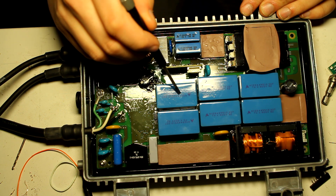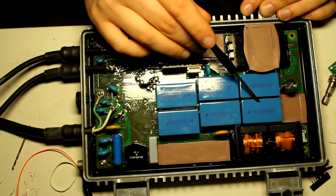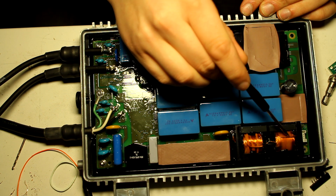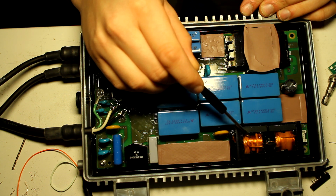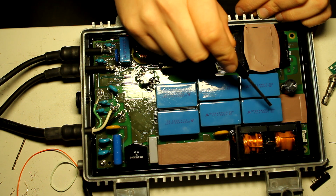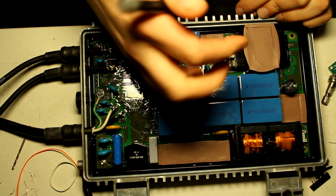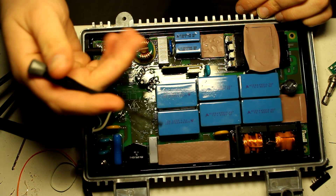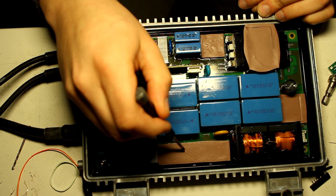They have relatively little capacitance compared to the amount of current these panels output, and they upconvert it to the bus. By modulating this transformer to draw more or less power, you can modify the power point it's tracking at. Then it puts this into a high-voltage bus and there's just a simple inverter - probably a MOSFET pair. Actually, this is a double choke - I think this is not even magnetically coupled. The idea here is that you switch the MOSFETs on and off fairly quickly and these inductors smooth it out, so you get a nice 50 Hz sine wave as the output.